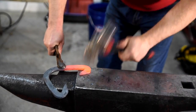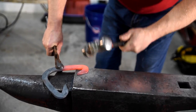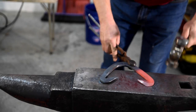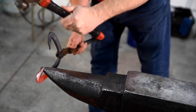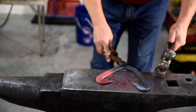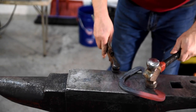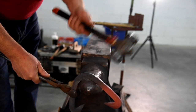So again, with the second branch, same formation as the first. Turn it using your marks that you've set up. Turn the arrowhead over, keeping the back straight on the branch so you don't get too much bend on it too early. If you get too much bend on it too early and then you turn the branch, you're going to end up with one side of the shoe shorter than the other one. So it's important to turn them as equal as you can and make them in pairs.